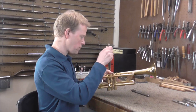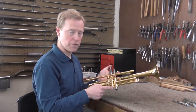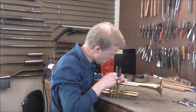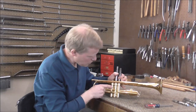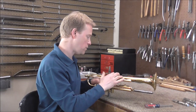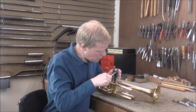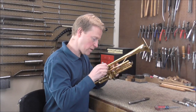So what I'm going to do is put the two ground casing mandrills into the instrument. Since these mandrills are steel, which is harder than brass, putting them inside won't damage the casings any more than they already are. I'm going to get a screwdriver and carefully pry those apart a little bit — what I'm doing is trying to take this brace and expand it. This is something you will not want to try at home because you can do serious damage if you don't know what you're doing. But it is interesting to watch, so you're welcome to watch and experience the joys of band instrument repair without messing up an instrument yourself.